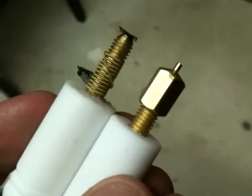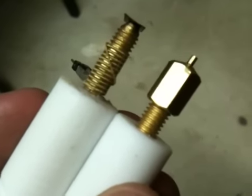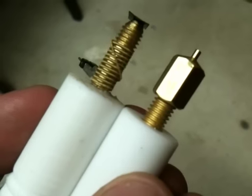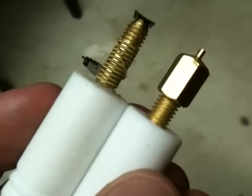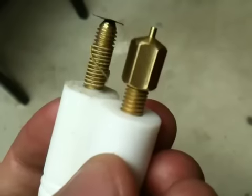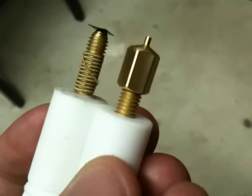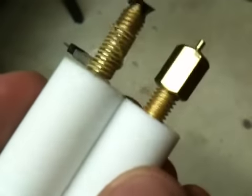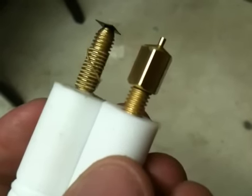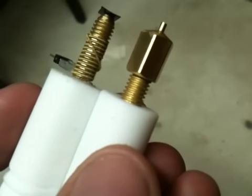It does come out to exactly the same height, and it would be a very short heat zone, which is one of the theories that would help with jamming. I did want to keep the zone that we heat very small, but I also don't want to wrap nichrome on top of itself because I think that's caused problems for me before.